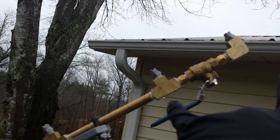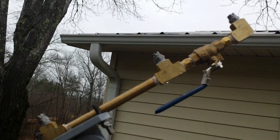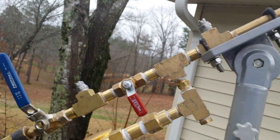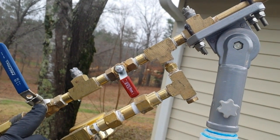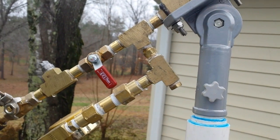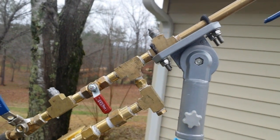These three are your water nozzles. You always start the pressure washer up with this valve closed. Otherwise, you'll send compressed water down the line into your air compressor if this valve is open and you've got no air. That's the risk of this style of gun. That valve either has to be closed or you've got to have airflow coming out, so you don't pressurize the line back to your air compressor.